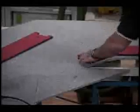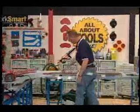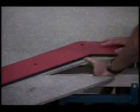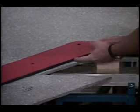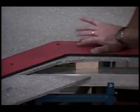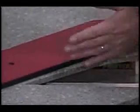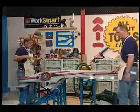Okay, so what we're going to do is put this on our long line here in the front, which will maintain the proper overhang that we want. And as we come out of the corner, this actually begins to overlay our line by up to a 1/4 inch down on this end. But once this joins the line right there, we'll stop the router, and then we'll make the connection or the intersecting point right at this radius. By doing that, it's not like we brought our cutout this far and then are trying to correct it and then have a kink in the edge. So it's right there at the corner. It's right at the radius. So we'll let the radius be our blending point, which visually will make it not stand out. And that's really what we want.